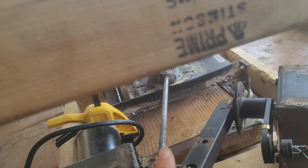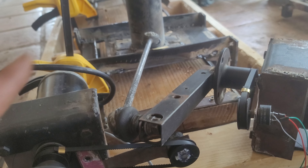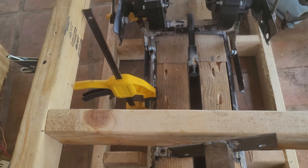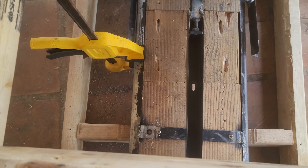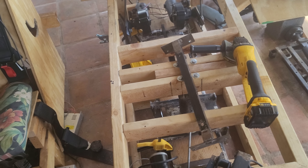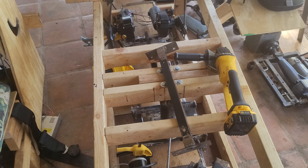I put the trolley with the u-joint on the rails, placed it in the middle, and then welded the rails onto those metal cross beams. After doing that it solved the problem I was having with way too much tension on the rails — them being twisted or uneven. That was resolved. It took a lot of time yesterday to figure that out and get that work done.